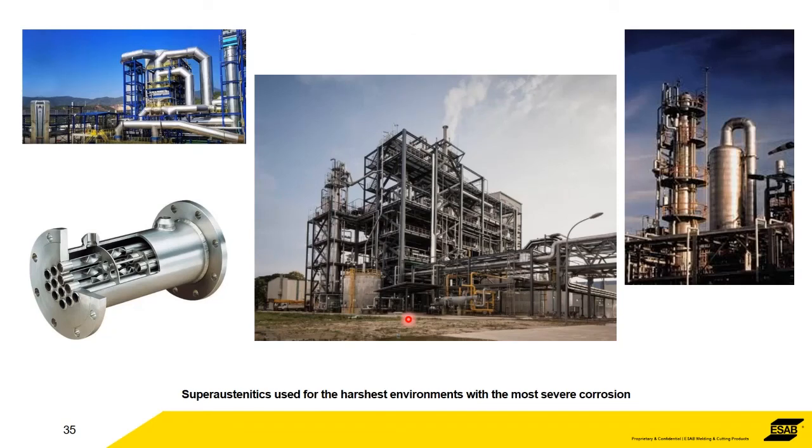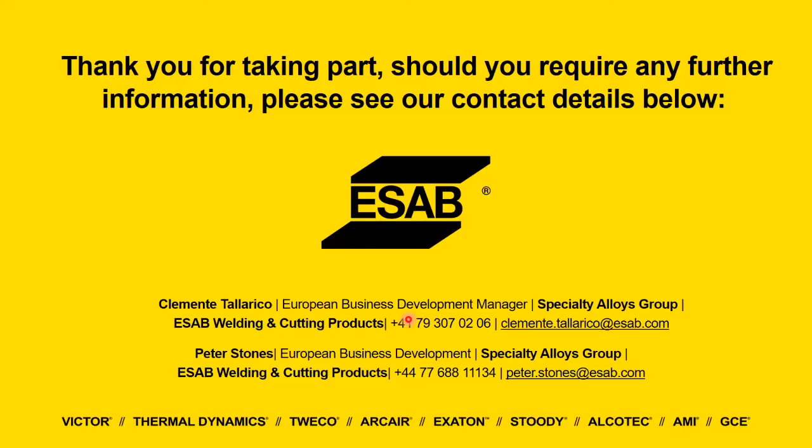The superaustenitics and those special grades that I showed you, they're used for the harshest environments on the planet. So concentrated sulfuric acid, concentrated phosphoric acid. That's what these are used for. And you have to be very, very careful with how you weld them. They want to crack.